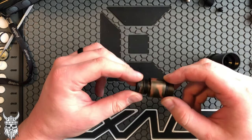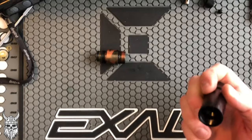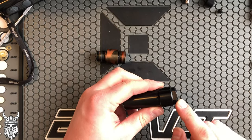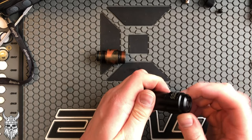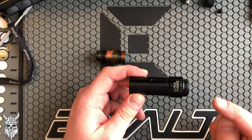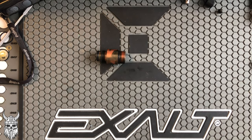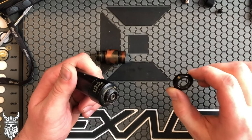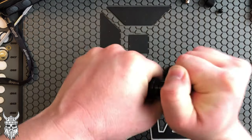Not very much to this guy. You got just the two O-rings, your piston. It must have been a while. So this collar comes off to be able to remove the O-rings for the swivel portion, but while this nut is Loctited, you can use it to remove the lower portion from the body. Ooh, interesting. Okay, the nut came off, which means we won't have to hit it with any heat, but this thing does need rebuilt.